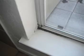There's a water leak at this window here. You see how it's actually damaging the windowsill. That's got to be fixed because left as it is, it could introduce mold into the house. Here we go at the next window. Again, there's a sign of water penetration at this window. This window's cracked.